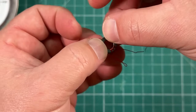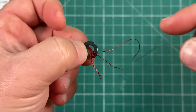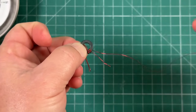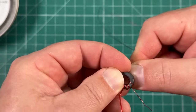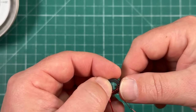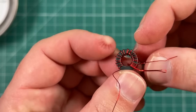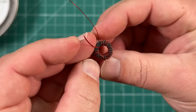This part goes to ground, and we want this second wire kind of in the middle. The extra wire we're going to wrap around 18 more times to give us a 3-to-21 turn ratio, which works out to a 1-to-7 turn ratio. And that's 18 turns. I'll spread them apart a little to make them more even. It ain't perfect, but it's honest work.